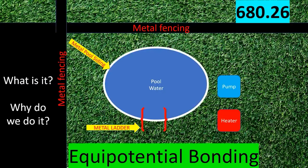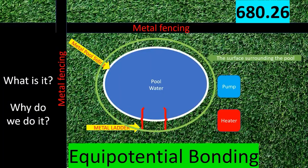One of the most important places to bring to the same potential is actually the surface surrounding the pool — whether it's concrete, aggregate, or grass — we want to bring even that to the same potential. That way, at no point can anyone dealing with the pool — whether in the pool or adding chemicals — ever be at a difference of potential if voltage were to leak. You might ask: shouldn't a GFCI trip, shouldn't a breaker trip? Yes they should, but they don't always function correctly, and voltage could be coming from somewhere unrelated to the GFCI or the pool.